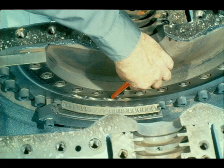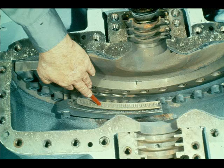The steam enters the casing through these nozzles at very high velocity and strikes the buckets of the first wheel. After the steam leaves the buckets of the first wheel, it enters these reversing buckets, which redirect the steam before it hits the buckets on the second wheel. In other words, these reversing buckets are positioned between the buckets of the two wheels. These reversing buckets should not be mistaken for a diaphragm — reversing buckets are used within a stage, while diaphragms are used between stages.